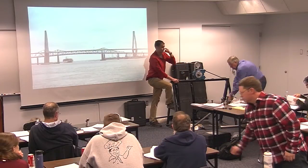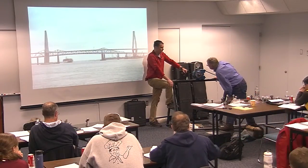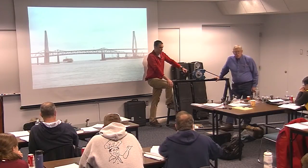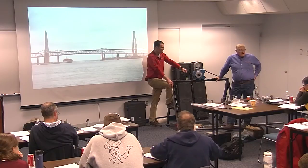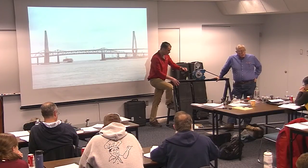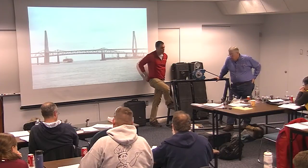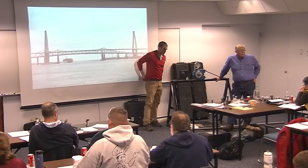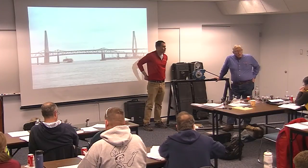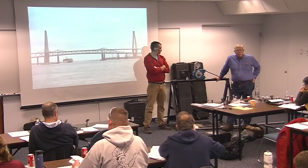We got a half a turn. We've got 56 kips on a half turn. This is pre-installation verification. So out of these 7/8 by 4 1/4 inch bolts, we got 56. Minimum required was 39. So we're about 30% or so, maybe a little over 30% above the minimum required.